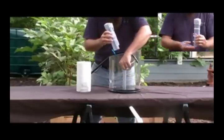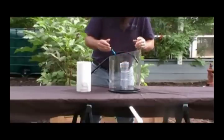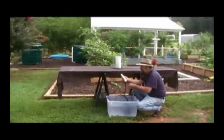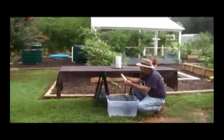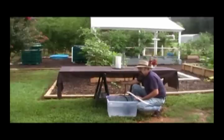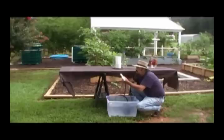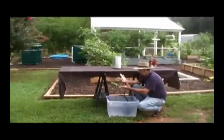Let's put this together. Our upright pipe goes in here, and I'll turn it so you can watch the snorkel. We slide the pressure chamber back on top — real simple, just lay it in there. The drain coming from underneath needs to be larger than your water intake so you don't outrun your drain — two or three to one on your drain. To make this work efficiently and create a siphon, you want at least 12 inches with an elbow before you turn down — I prefer 24 inches. That pipe creates a stronger siphon and helps the system work much more efficiently.